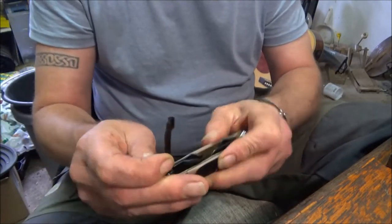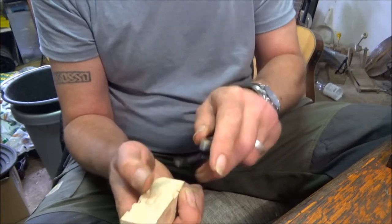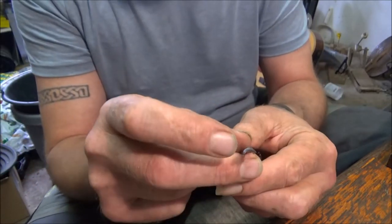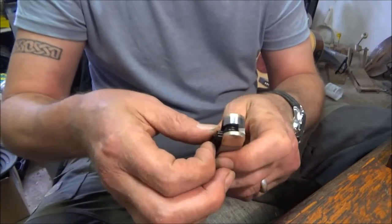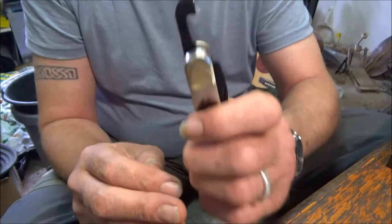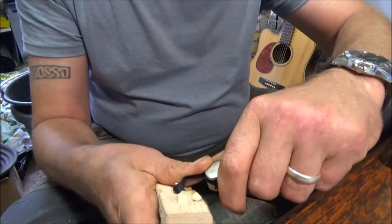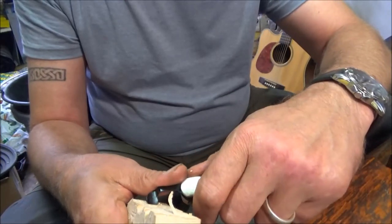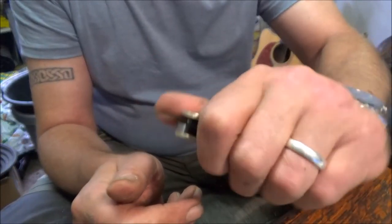On this side we've got all curved blades. There's a straight gouge - again pushing - but that's actually not bad for sharpness, that's quite good. They've all got paint on the back so that all wants polishing off. There's a little bit of a burr on the edge that just wants knocking back and then cleaning up. There's also a little gouge on the side - I really do like that because you've got that control. That's not bad for sharpness either. You can do the same sort of job as that main gouge - it's a bit wider obviously - but for spoons and stuff like that, that's quite sharp, cutting in both directions.